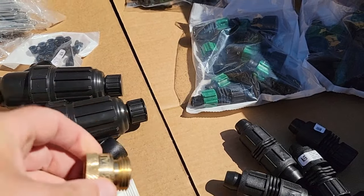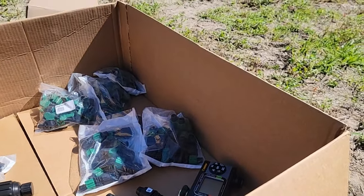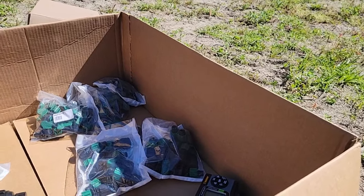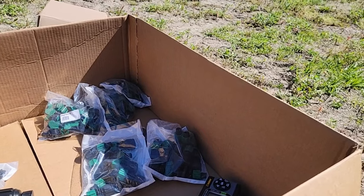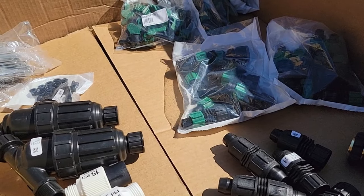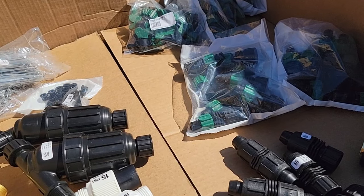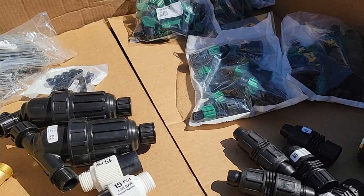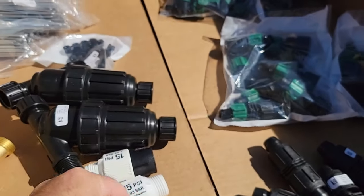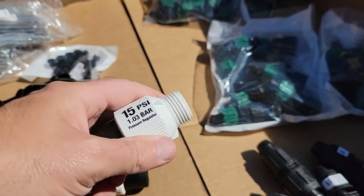We chose the straight digital timer because there were too many bad reviews about people not being able to connect via Wi-Fi, and those timers don't have a digital display. I was concerned something would happen and we wouldn't be able to connect, so we went old-fashioned. These here are backflow preventers. What a backflow preventer does is ensure that if something happens, water will not flow back up into your main water system — pretty much all houses and commercial buildings have them to keep water pressure going only one way.